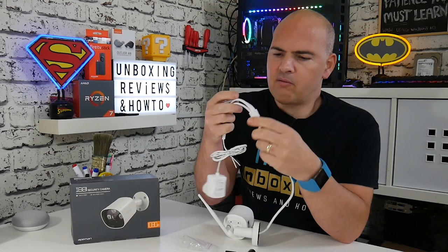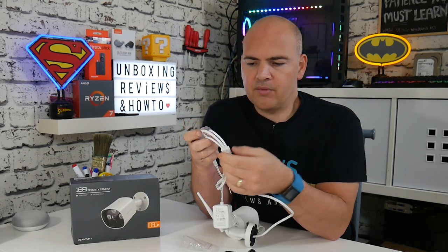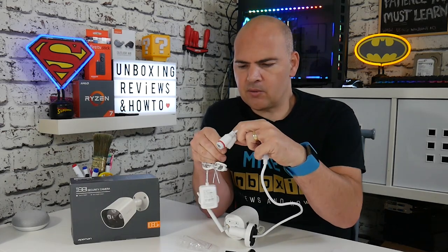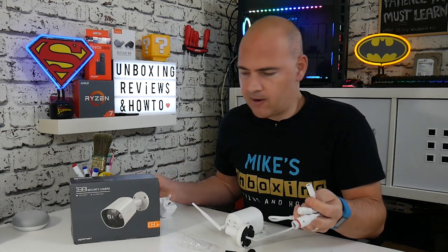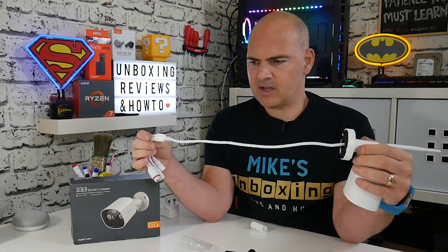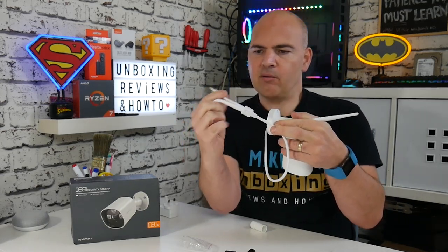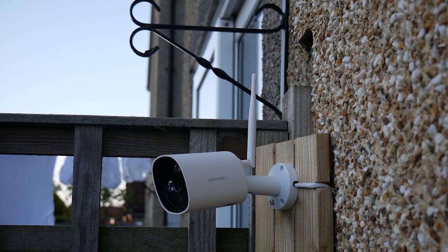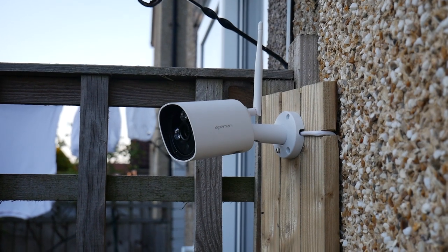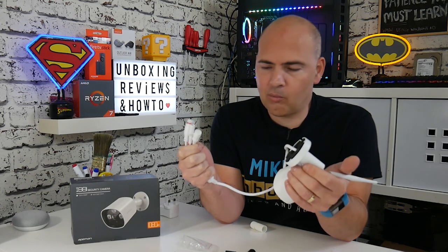But again, this is one of my concerns. I would have rather seen this particular cable coming from the camera to the splitter being considerably longer. This is actually going to be quite difficult to hide or disguise or nicely cable manage, especially for those of us here in the United Kingdom where we have generally cavity walls — a line of bricks, cavity insulation, and then another line of bricks. To get that cable through two lots of bricks and the cavity, you're probably going to have this section either sticking out of the wall or have to push it back into the cavity, which then loses your option for using the reset switch. So depending where you're planning on installing it, you may have to carefully plan your wiring route.